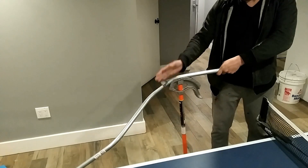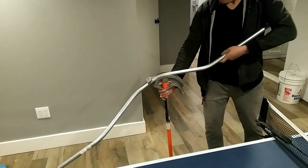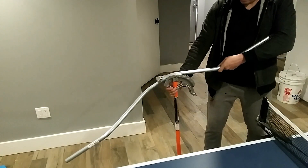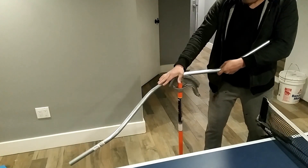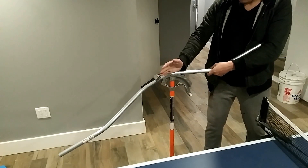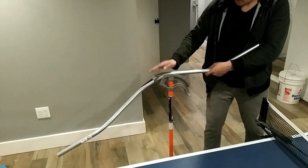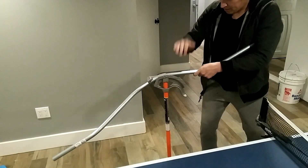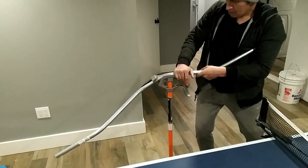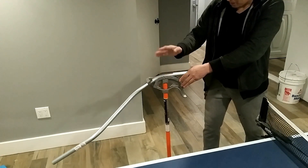You have your first offset done and you're ready to rotate it — and you rotate it in this direction, which is for my inside corner offset. I have it on my point C and I bend it down to 30 degrees, making sure that everything is level and straight and not dogging it.